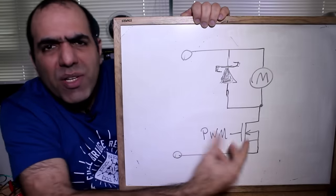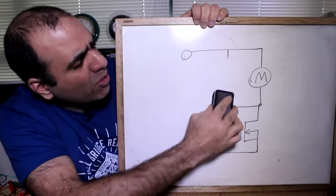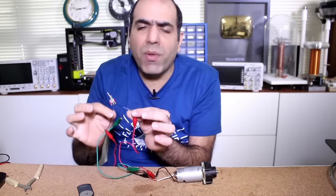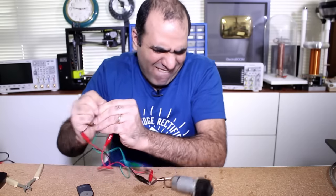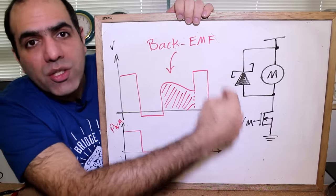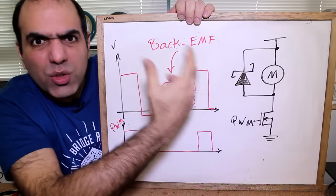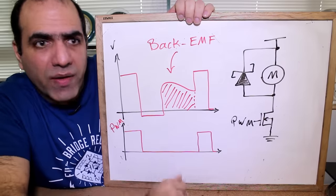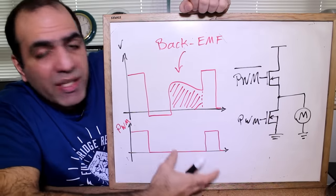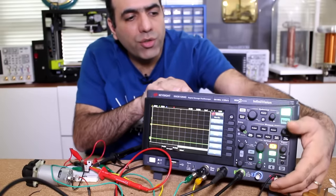So far we've been driving the motor through a single transistor. It's time for a half bridge driver. Running current through the diode wastes power, so if we replace it with a low on-resistance transistor we save much more power. When using a half bridge the PWM frequency must be fast — faster than the inductive discharge time — otherwise you stop the motor every cycle. An important thing running a half bridge: the two switches must never turn on at the same time, otherwise they'll short the power supply, a huge current will shoot through them, and they'll blow up. The control signals must ensure one transistor turns off before the other turns on, and for safety we keep a dead time gap during which both transistors are off.